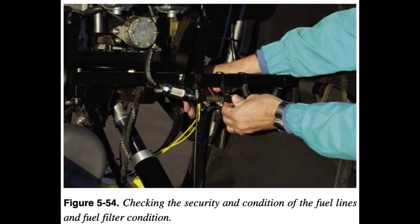Fuel System: 1. Inspect fuel tank attachment and condition. 2. Inspect fuel vent system and ensure the fuel supply line is open. Some WSC aircraft have fuel shutoff valves outside the fuel tank. 3. Inspect fuel pickup and fuel line running up to fuel filter. While inspecting all fuel lines, jiggle all fittings and connections to ensure they are secure.